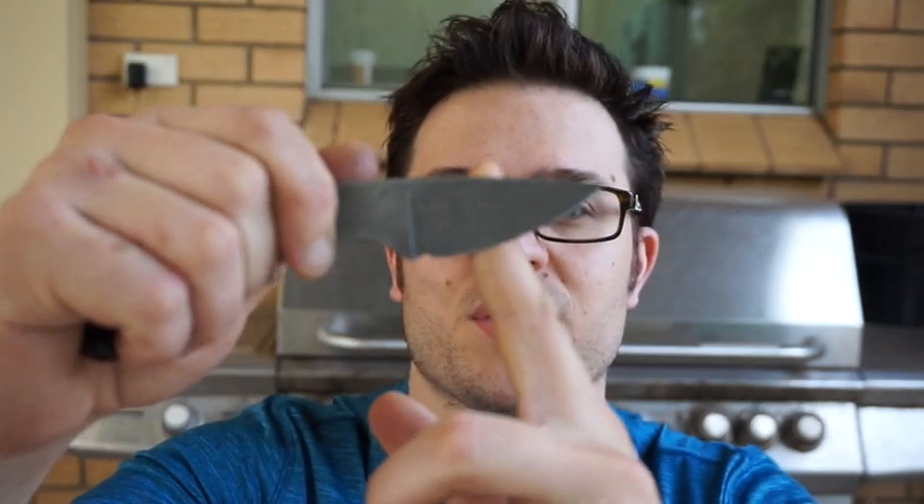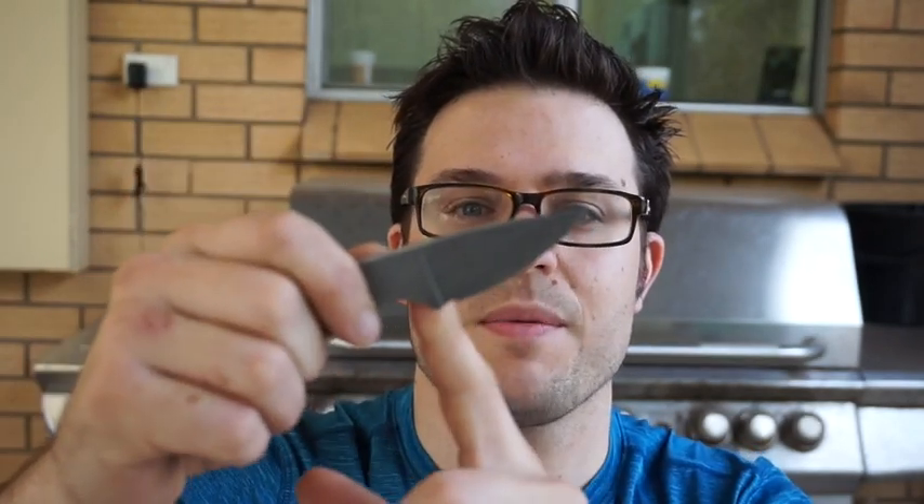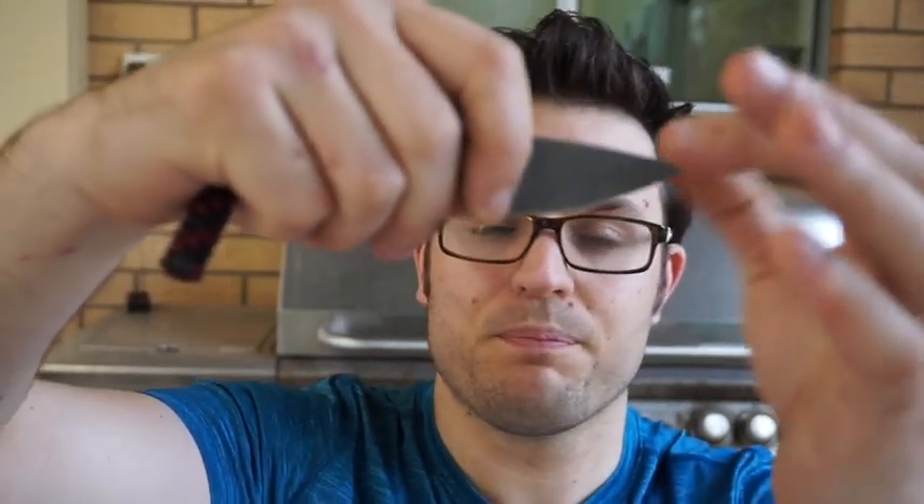If you think about it, that much of the blade is working twice as hard to do the same amount of cuts as if you're using the full blade. Usually I use the belly and it's about an inch and a half long. I was really conscious this time — I took my time and made sure I used the entire edge. 108 is a really good number for a non-powdered steel — it's up there, getting towards good D2 or 154CM and things like that. Probably a lot to do with the Rockwell — running it at 60 or 61 is a good idea if you're after edge retention, which is great for a small knife.